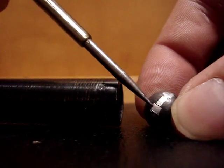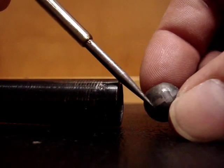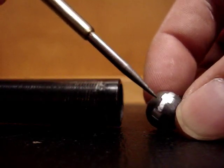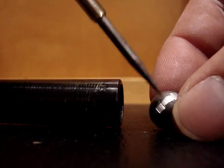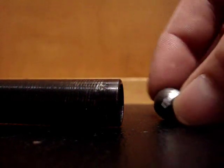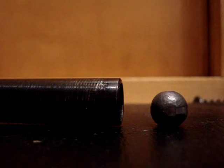Remember, this is the land and this is the groove. You're going to measure from this side to the opposite side — that way you get a good accurate reading of your bore diameter. Once you determine that, you have to make a few choices: whether you want to get a sizing die of that exact diameter, or go a thousandths above. Sometimes I go a thousandths above, sometimes I don't — it all depends.